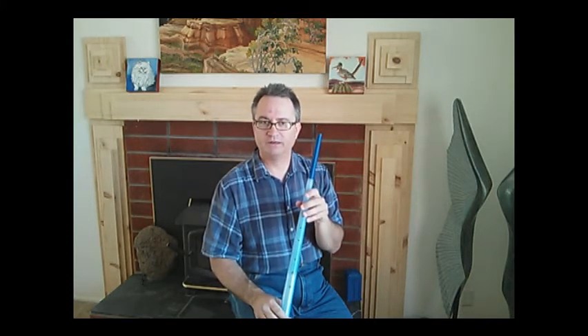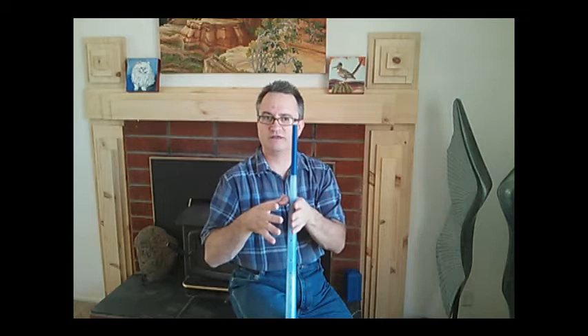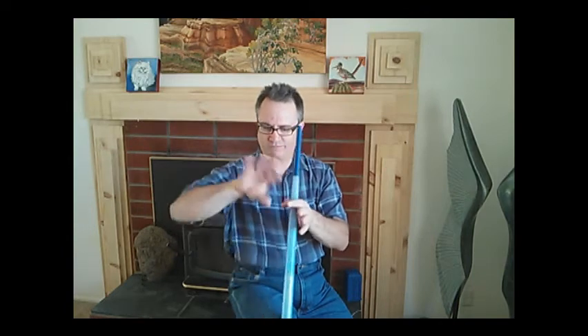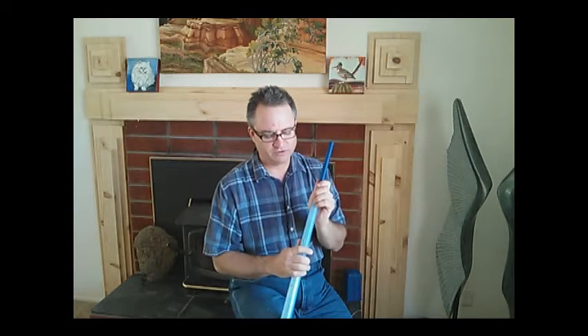With 3D printing, you have basically what would be called a shell. Like if you were to do a regular cylinder, each shell would be just basically going in towards the center. Because this is in effect a hollow truncated cone, you really have one surface that goes on the outside and then in and out again. So the shells come in from the inside going out and from the outside in. What I did was I printed as many shells as possible to get it to be airtight. The top three pieces are solid.